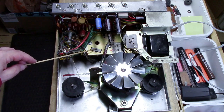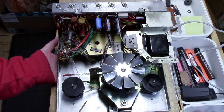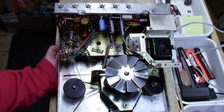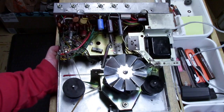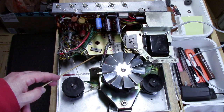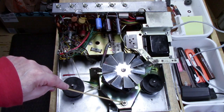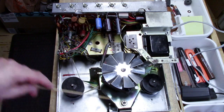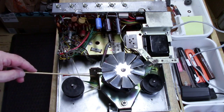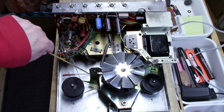This is an interlock for the record/play switch — it just simply goes up and down. The mechanism that works with it is under here, which you can't get to. To get the motor out you would remove this bolt, but there's a plate here that's all wound around back inside and doubled back on itself onto these plates — there's one on each side — and that's what's bolted to the main chassis board. You can't get that out either. So this is not a service-friendly machine.